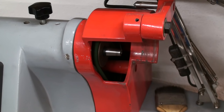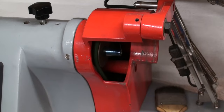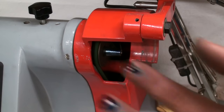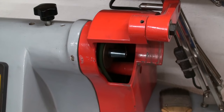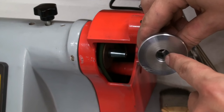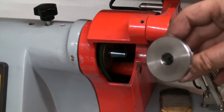Let's get some spotting blue on there — just a very thin film of it. That's the technique the pros use. Now we get our taper on there. As you can see by the bluing, we are carrying contact pretty much all the way down to the end. It's almost a bit wide on this end, but as it pulls on, that's fine.